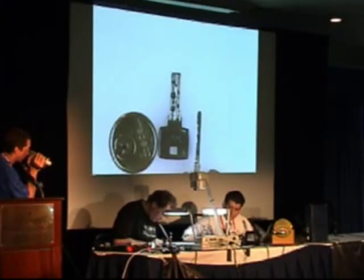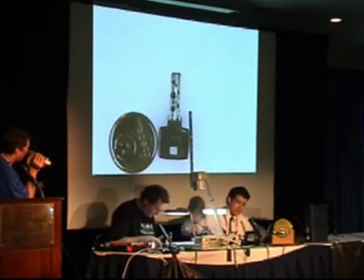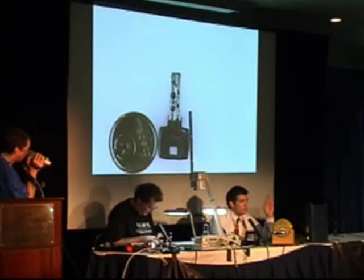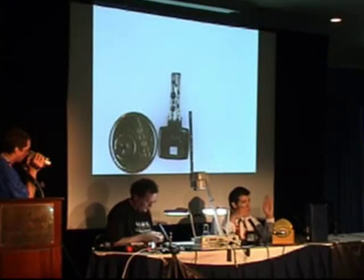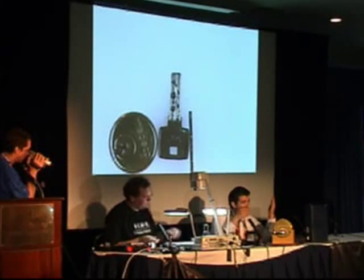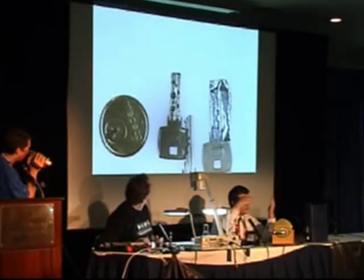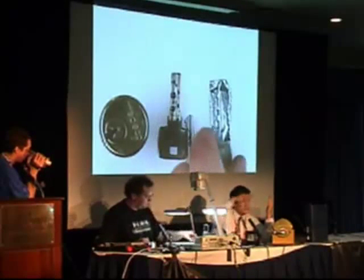You see those angles? If you look at those angles, what they're doing on the inside is the pins spin up to a third, I think, up to about a third. And in the side of the pin, there's a slot, so that once you spin it, it has to be in line with that slot. What happens on the side is there are a bunch of fingers. Those fingers have to go into the slots for it to turn. So you both have to do up and down, and those angles.